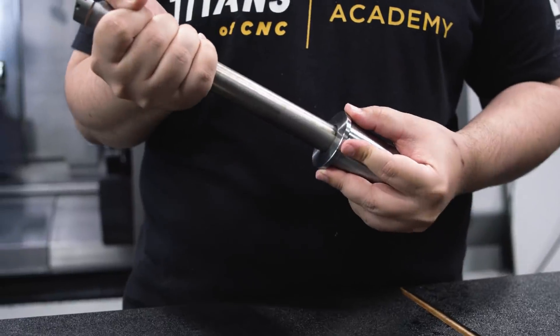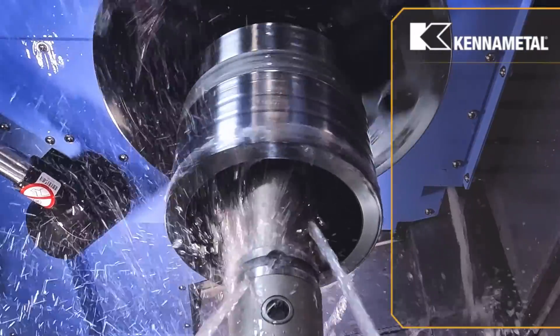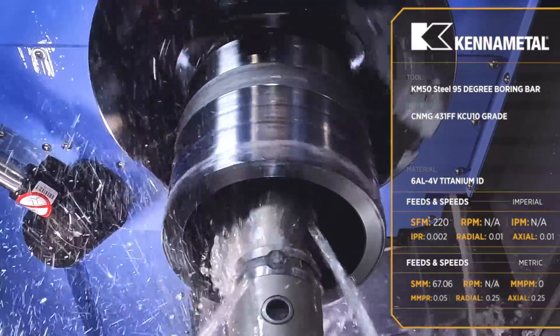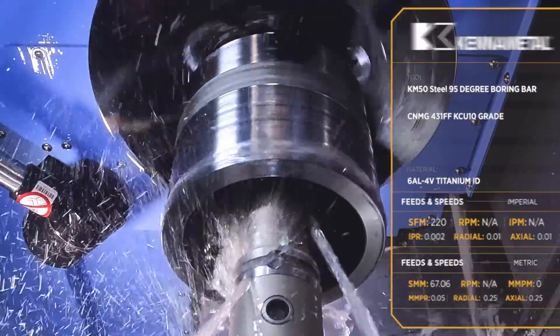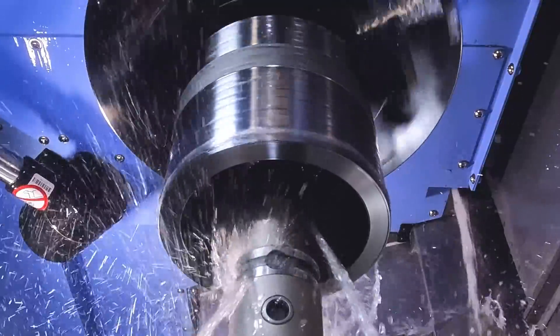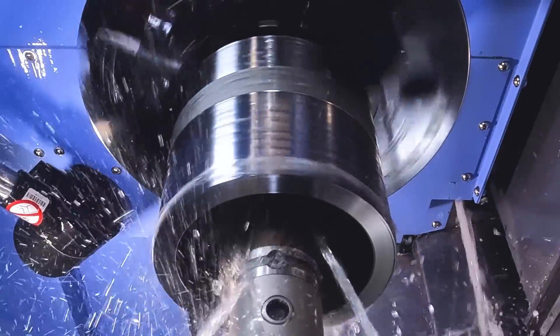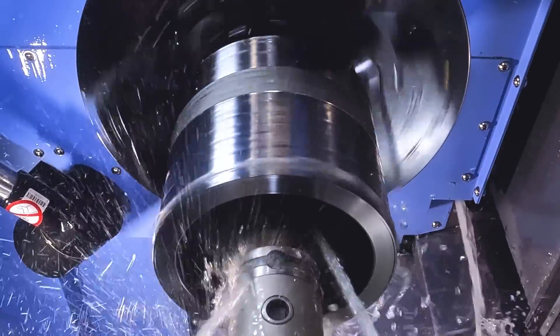I have the same tool from the steel. I just dropped the SFM down to 220 and I'm keeping the same feed rate. I'm backed off 20 thousandths for my final size, because after I run it once, I'm going to measure it, and then I'm going to take it up however much I need to nail the tolerance.